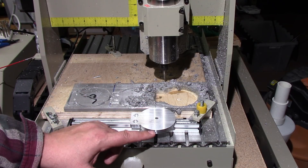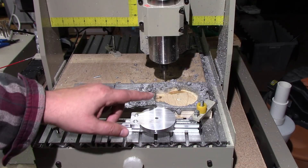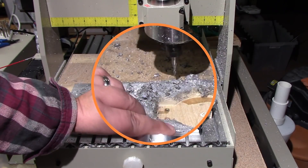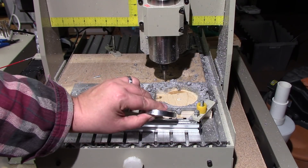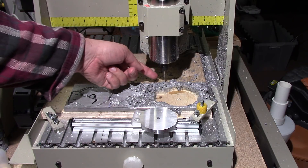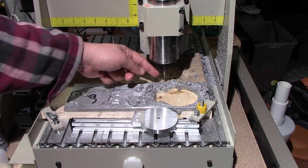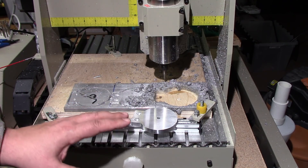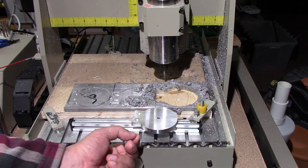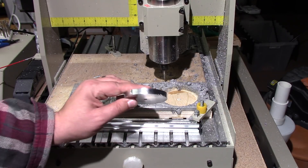One of the reasons I try to avoid tabs is I took this down basically past the aluminum, a little bit into the wood. And what that did is — I don't know if this side really came out — but this side came out super clean. I mean, you could buff that up and it would be excellent. What happened is I did a couple passes, probably about two passes going into the wood, running around the outside to really get it clean without the tangential force of it pulling against the aluminum. That little trick usually provides very good results, and it did.